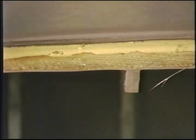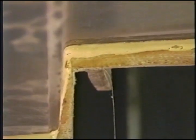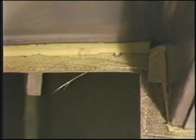Here you see there's quite a bit of glass hanging out. The laminates of the side of the fuselage and the gear leg tab, you can see them both sitting down there. We're going to cut that all off with a saw. We're going to cut the vertical portion off on the left there and the vertical portion hanging out on the right so that it'll be flush all the way along.